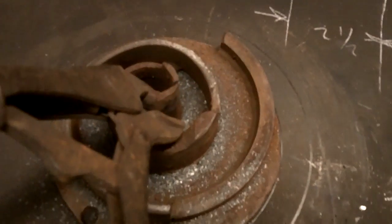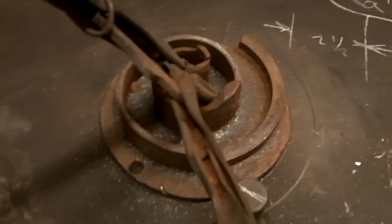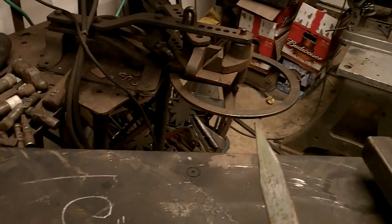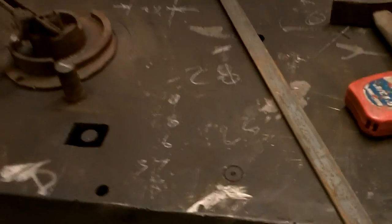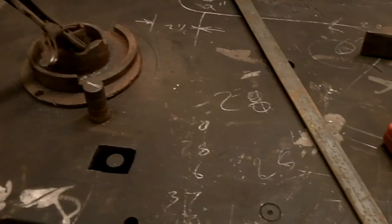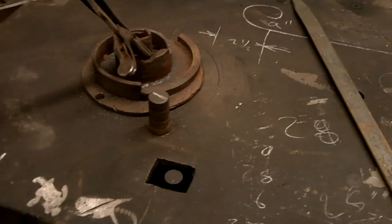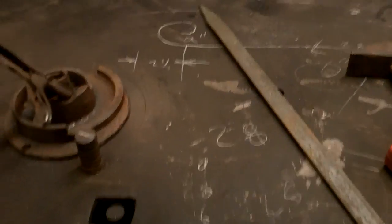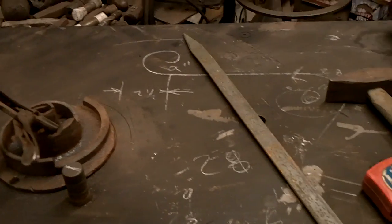This is a die that's in here now that bends a nice scroll. It has the vice grip there so that you can grab a pointed rod, because as you know, if you have a point on the end of a bar, a regular scroll maker won't work. It'll just slip out because there isn't enough friction to keep the thing in there. You end up with that big ugly squared off end. This machine solves that problem, and I'll show you how.